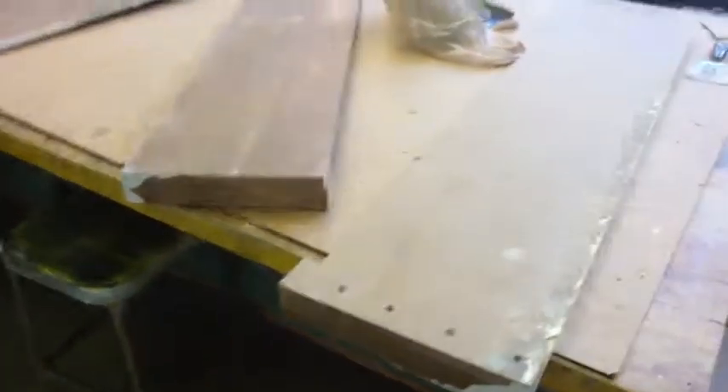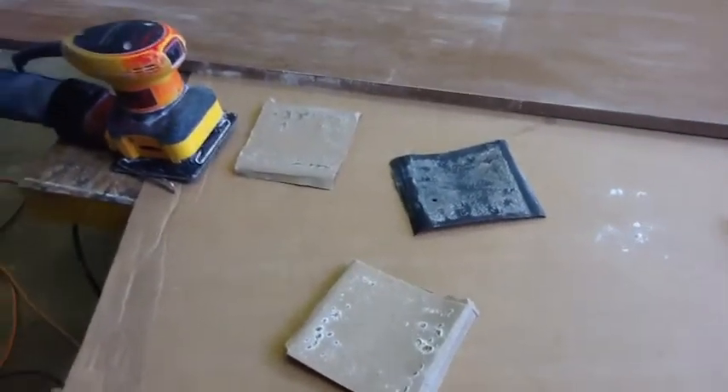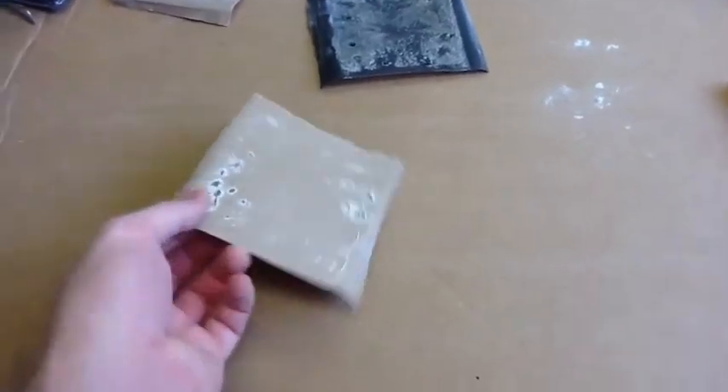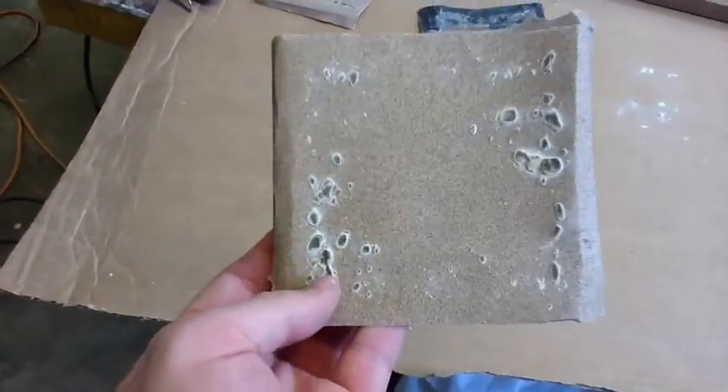Here we have the cast forms I used to make the larger model shown earlier. They're pockmarked, dirty, and have clay and plaster stuck to them. We're going to have to clean them and sand them down completely before covering all of them with shellac to make them waterproof and more durable going forward. I'm cleaning up each piece with a standard plaster putty knife — the wide flat blade is ideal because it won't damage the flat sides when removing the extra gunk. You should only ever use it on the bottom and back of the piece. Now we're going to sand the large boards using a high grit so the next shellac coat can adhere. Note that sanding creates waxy bubbles that you have to scrape off or change the sandpaper constantly to get the result you're looking for.